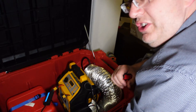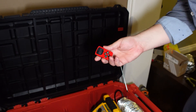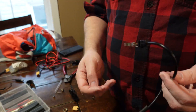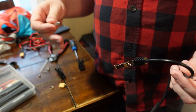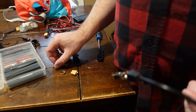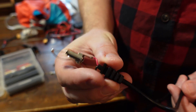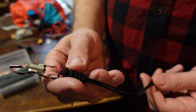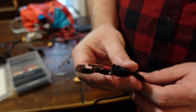She needs a little fuel and a test weekend and a couple of batteries. This is for glamping — turn up the heat right from the inside of the tent. So this is a little discouraging: I look at this fuse and it's 15 amps. I need at least 10 amps to run this diesel heater plus some lights and whatnot, so I'd like to keep the source at least at 15 amps. When I cut it to put my own XT60 on there, see how thin this wire is? There's no way in the world that's going to be good for 15 amps. So I'll have to take this all apart and make my own end piece that's better rated for the load that's going to be on here.